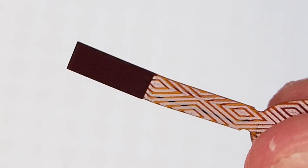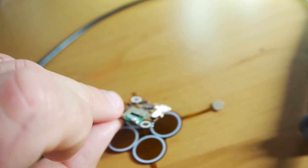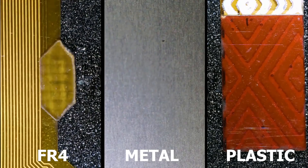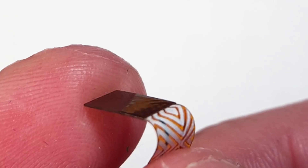The first rule is that you always need to use a stiffener. A stiffener is a cheaper alternative to flex-rigid PCBs — it basically keeps the electronics region safe while other regions remain flexible. It can be a piece of FR4, metal, or plastic that the manufacturer can integrate with your design to prevent areas from bending.